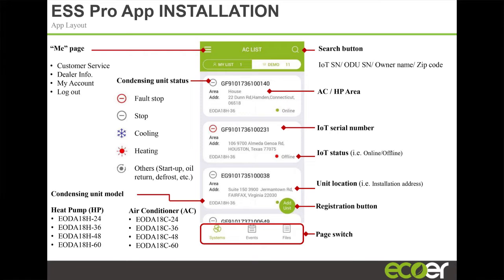And he called our tech support center in November and said, hey, my homeowner, the unit worked fine in the summer, it cooled quite well, and now in the winter, I need heat and it's not heating. I think I need a new reversing valve. The reversing valve is not working on the product. We pulled up the system. They had an IoT gateway, so within a second, we told him, hey, your unit was configured as a cooling only. Just switch the dip switch, and it'll be a heat pump. He did that, and it started heating immediately. He was ecstatic. Had it not been an Ecoer unit with the IoT gateway that we could see, he probably would have gone out, changed a perfectly good reversing valve and spent hours charging his customer